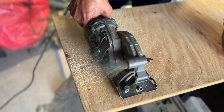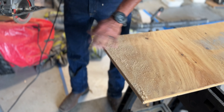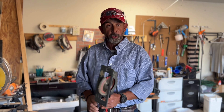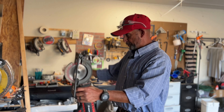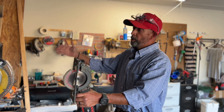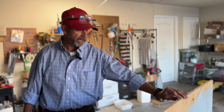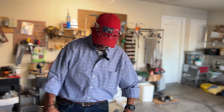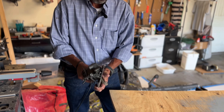Some people might not know why, so let me clarify. Take a flat piece of plywood and try to cut that on the miter saw — it's just not going to work. This is why you cannot cut large pieces of plywood or slats on a miter saw. It's only designed for angle cuts or cutting straight through short pieces. Not large, but long — long boards would be considered large in that sense — and wide. Twelve inches wide? Yeah, not going to happen on a miter saw.